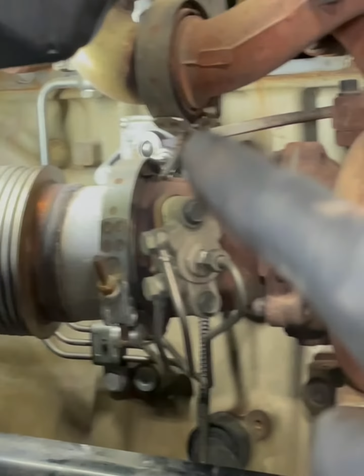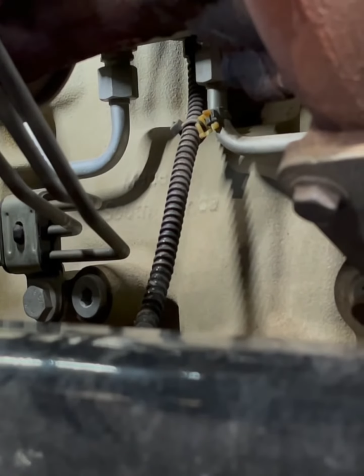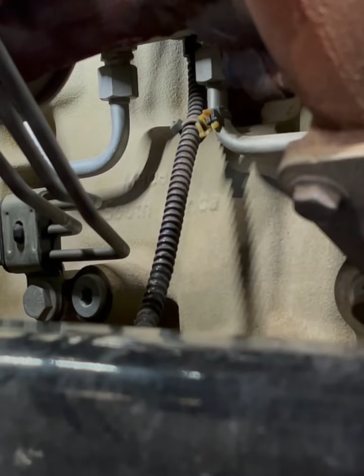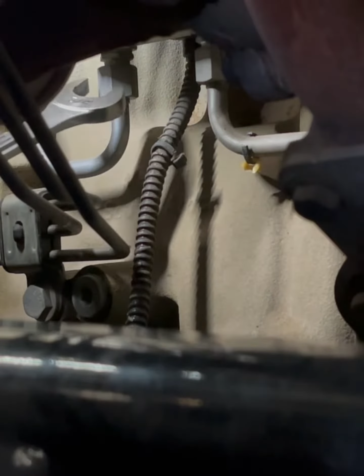All right, now that that's done, we can go ahead and take out the coolant lines and then unbolt it. All right, so under here, you are looking underneath the turbo exhaust pipe and at the bottom of the EGR valve actuator. As you can see, there is something we have to cut to get it out of the way, which is that harness. Just cut that zip tie, because it was tied to the line. Cool. Get that out of the way. I believe it's a 3/4. Let's see if I'm right. Yes, it's a 3/4.